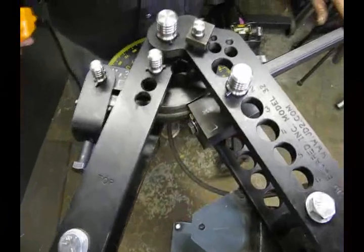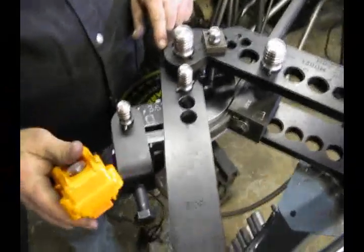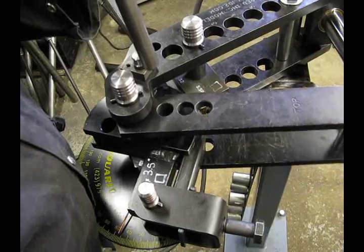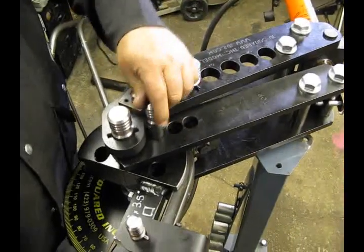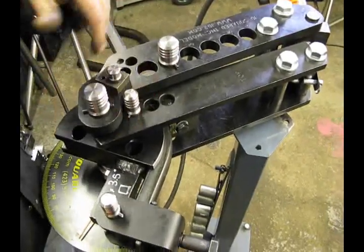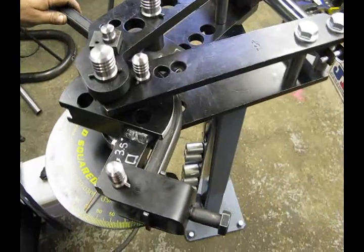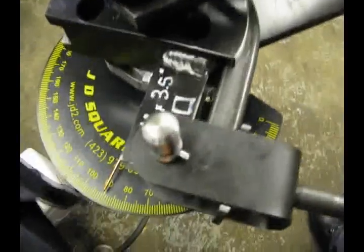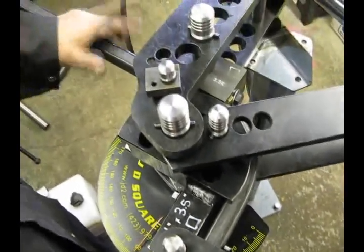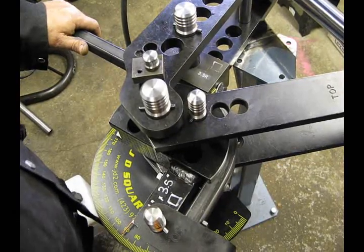Watch this pin. Once that drops in, we're going to stop because we want to repin. We're at 50 degrees now, so we can back off and remove this pin. We're going to bring the arm back, make sure that we drop in, and we're ready to proceed with our bend. Now we're going to come around to 90 degrees. At this point we could stop and take the tubing out, but most likely we won't be at 90 degrees because of spring back. So we know in this case we're going to use about 94 degrees.